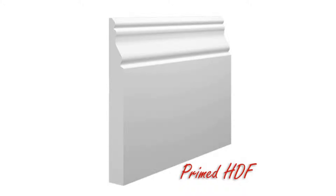All of this explains why a good chunk of the public will lean towards prime finish rather than unprime. Prime finish refers to a piece of skirting or architraves getting coated in white paint. This allows for a much smoother finish than an unprime piece and will protect it from certain elements such as dust and dampness. Although the prime finish is beneficial, it's not the end of the process. Now let's get into the different finishes that can be applied.